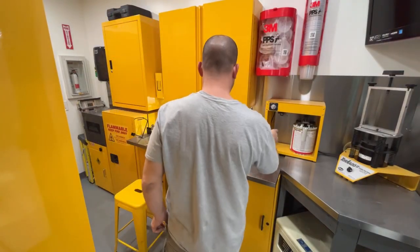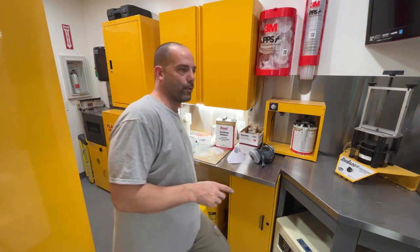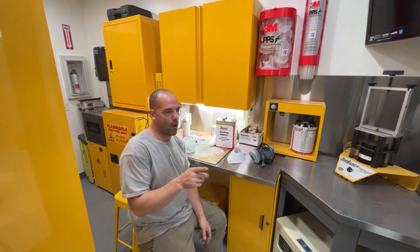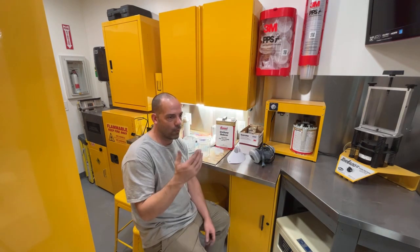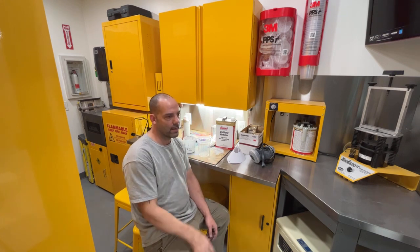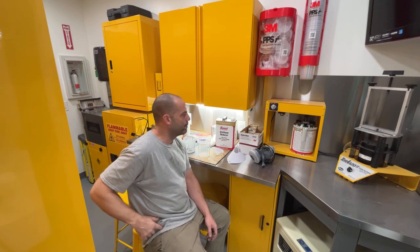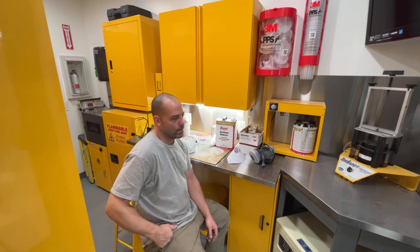Primer is mixing up. We're going to put three coats on the cabinet. The reason why I want to put three coats on is because that particle board is pretty porous and rough. It's not really rough, but it's porous. So three coats should fill it in nicely. And then we'll do two or three coats of paint on it tomorrow. That should be more than enough,